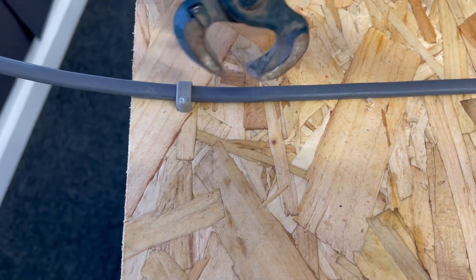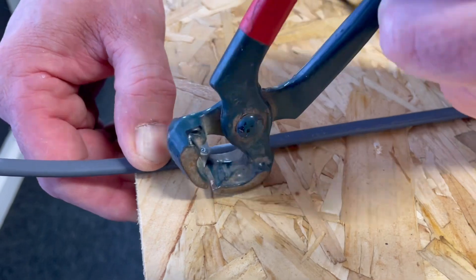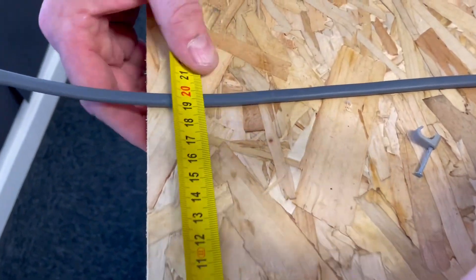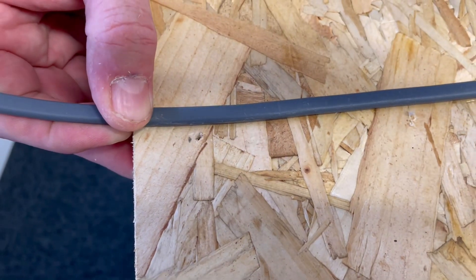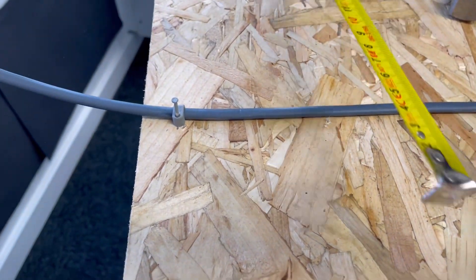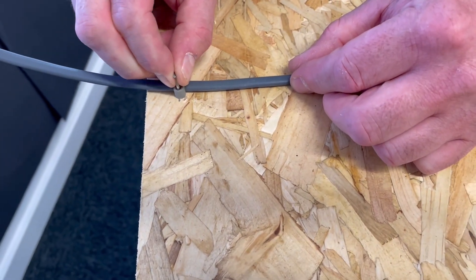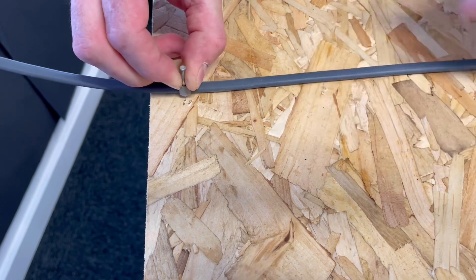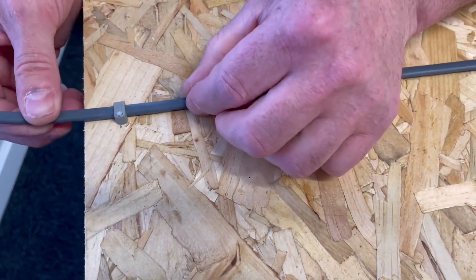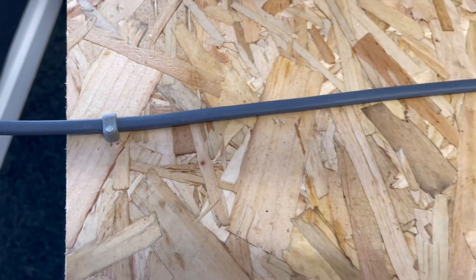We're not quite at 19 and a half, so it gives me a golden opportunity to show you cable pincers - you hold on to the nail, squeeze really tightly, and just roll it out. That pulls out the clip. We move it further over, check again - we want to be 19 and a half centimeters across. Put the clip in and pin it - meaning not driving the nail all the way in - because I need to know for measurement purposes. Then check again to see if we're at 19 and a half before fully committing.